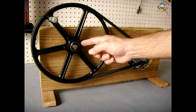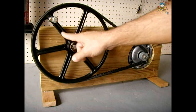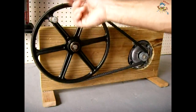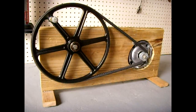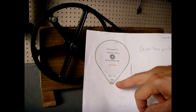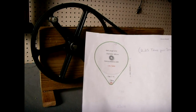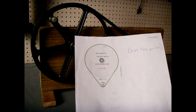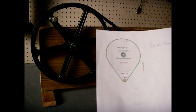The large pulley from the air handler had a one-inch bore, which I reduced to five-eighths using a bronze bushing. The handle is made from a four-inch bolt — I drilled a hole inside the cast iron pulley, put a washer, and slid a brass tube over it so the tube can rotate freely. For every one revolution on the large pulley, it results in eight revolutions on the small one — an 8-to-1 ratio. If the large pulley is rotated two and a quarter turns per second, you'll have 1000 RPMs on the one-and-a-half inch pulley.